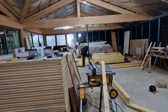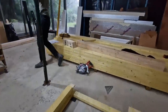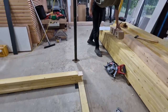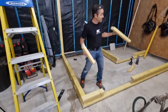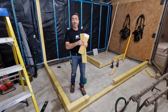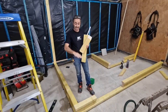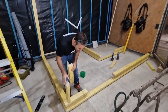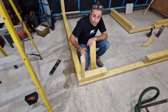Ed's over here getting ready for the glulam corner post — he's making a housing in the sole plate and then he's going to cut down the glulam and make it fit really nicely in there. We're getting the stud work done. We've got our double sole plate: one on the ground fixed with concrete screws on plastic shims, and then one that runs on the upright, which takes our proper sole plate up to the right position.